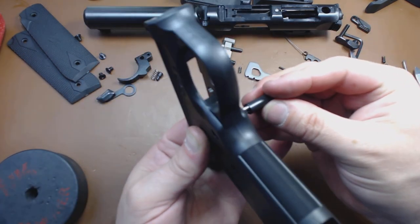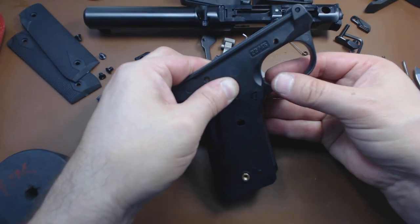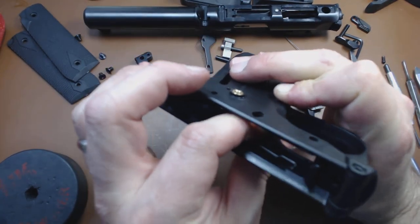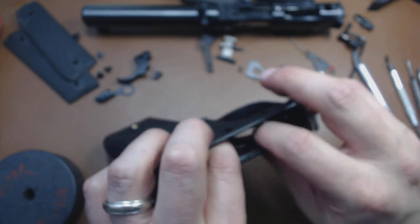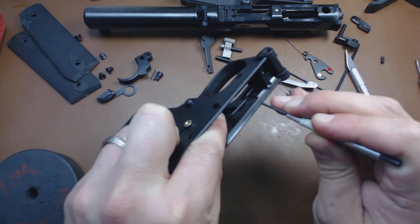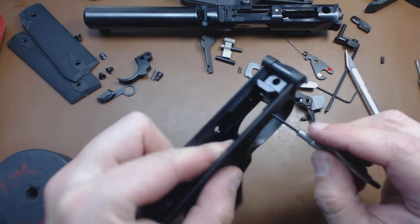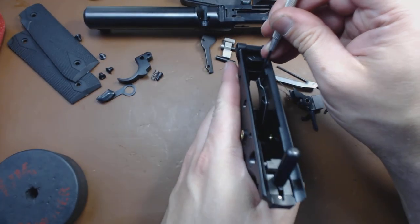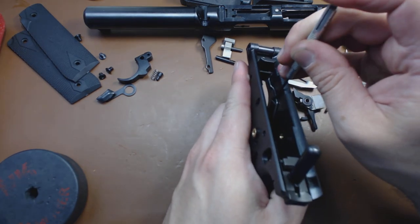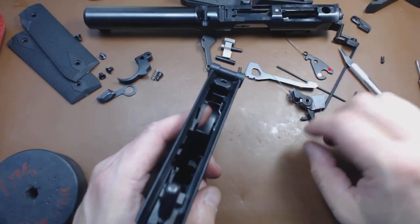And then you're going to put in the magazine catch, and it's got, you know, a half moon shape, so you should just be able to fairly easily see when it's lined up. At that point, when it's lined up, just push it all the way through and then rotate our little spring forward, and it's going to catch that. And I'm just holding the finger in there for good measure. And what I want to do now is make sure that this little spring gets tucked down into the frame properly and is caught in there. If it is properly caught, then everything should work. We should have a little bit of spring force there. It should be pretty far forward and down in there. And that's great, because now it's holding in our magazine catch and it's ready to hold in the trigger pin.